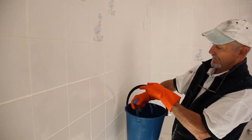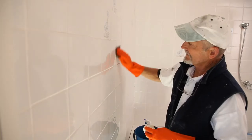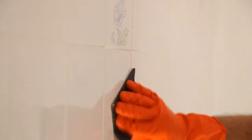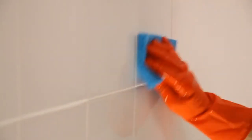If you've got any mould, give it a scrub with one part bleach to three parts water and rinse it thoroughly with fresh clean water. Once dry, give the tiles a light sand with 240 grit wet and dry sandpaper. This will help paint adhesion and give an even better finish. Then wash and rinse again and let the tiles dry thoroughly.